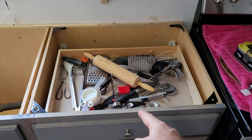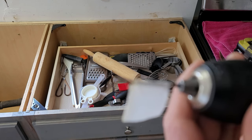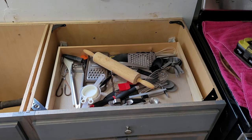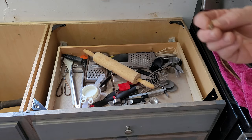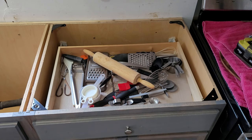I think this front piece of wood is just so much harder, and plus it's deeper. When I tape off my drill bit, you can see it's chewed up a little bit because I tried to drill this one out more, because my screw heads keep popping off on this front part. These are the screws I'm actually securing the counter with, the ones that come up through these holes in the brackets, through the fender washer, that actually lock the counter down.